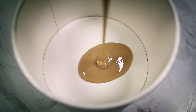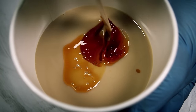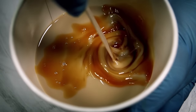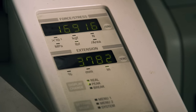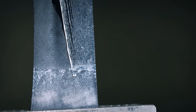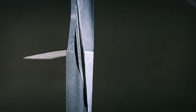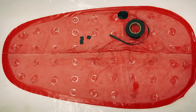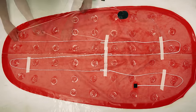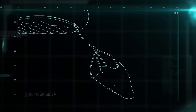When the raft is assembled, it has to be watertight and maintain its buoyancy. The super glue that does this is made by mixing neoprene and a chemical activator. The glue is mixed daily, and every batch is tested. The bond has to withstand at least five pounds of force. If the glue doesn't make the grade, any rafts made with the batch are rejected. Next, high resistance nylon cord will be placed into the floor to assist in inflation. The cord provides a pathway for the gaps between the layers of compressed nylon. Another cord connects the sea anchor known as a drogue, which slows and stabilizes the raft in high seas. While the stranded search team waited for help in their protective canopies, their life raft's anchor also kept them from drifting off course and being lost at sea.